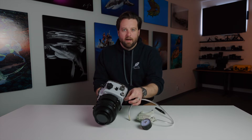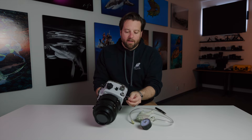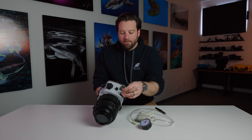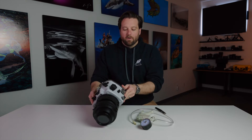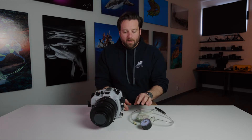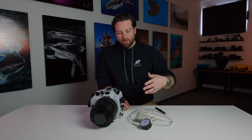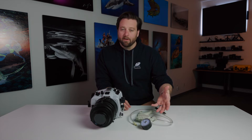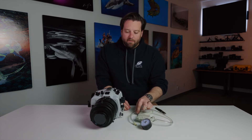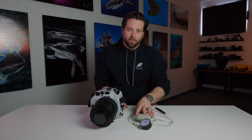I don't have the cap plugged in right now because of that one-way valve, but I do suggest putting it back in because that's just a good habit to get into. Place it there and while it's sitting overnight, it should hold that vacuum overnight. The reason you don't want to leave the pump installed is because it isn't designed to go underwater — so if there's a leak or a hairline crack in the pump itself, you'll notice the gauge drops, and if it's attached there's nothing that indicates where that leak occurred.